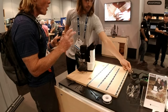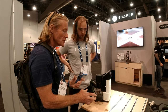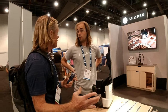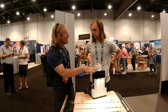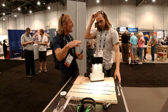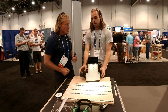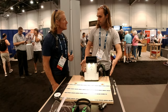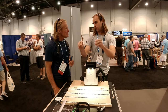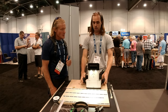Is this a smart router or a handheld CNC? Yes — you're doing it with your hands. So I've got my workbench and I'm going to be cutting it out of a 4×8 sheet of plywood. I set that whole file up for the top, and you just follow the screen — everything you need is programmed in, it'll be cut. You'll make a grid, have a bounding box that matches the top, place it from a corner, and everything will be in the right spots.